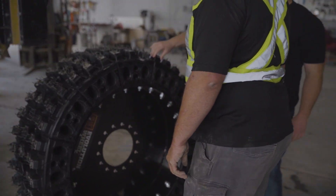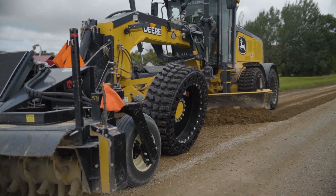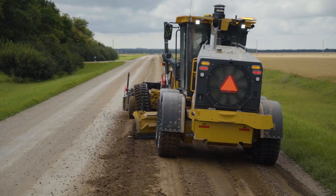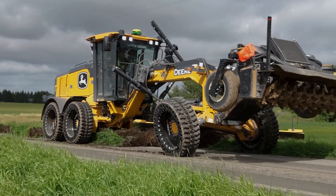With our motor grader tire development project, we basically wanted to take them out on a grader and test them in a variety of different applications — low-speed grading on a gravel road, high-speed grading in mud, doing some rough cutting and moving some dirt, and just seeing what traction is like, what the performance is like, if there's any hop or bounce. We just want to do some general basic testing here.